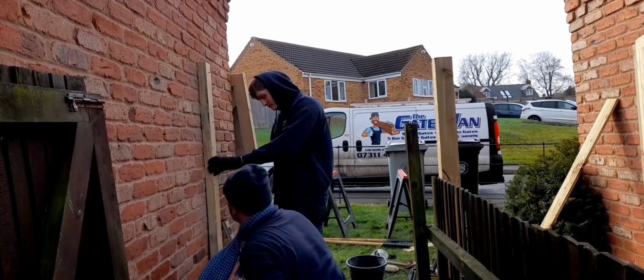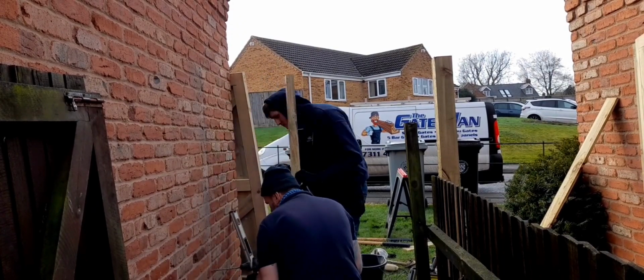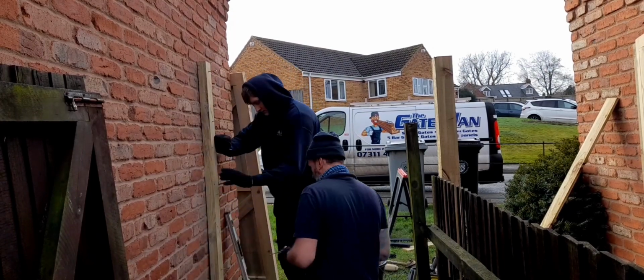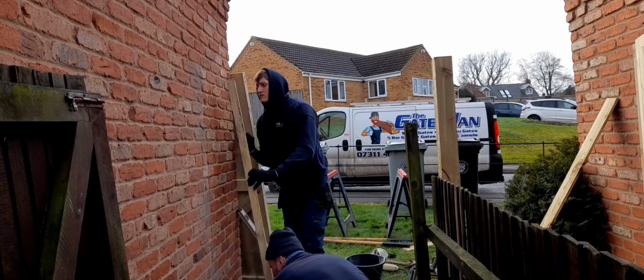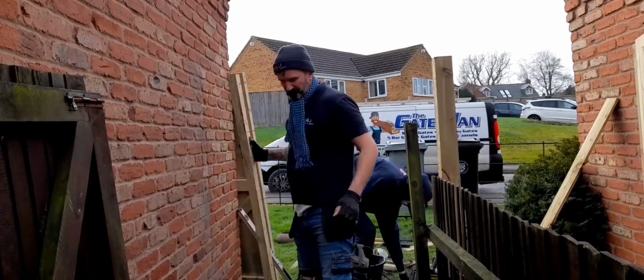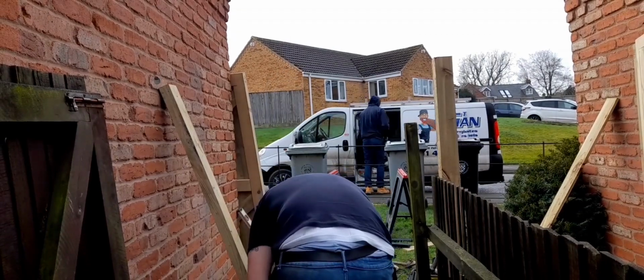And then with the wood, I'll countersink the hole with the 20mm countersink. And I'll also use an 8mm wood drill bit to go through the hole, so it doesn't put so much pressure on the screw when I screw it into the wall, into the plug.